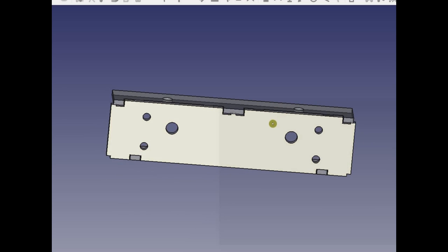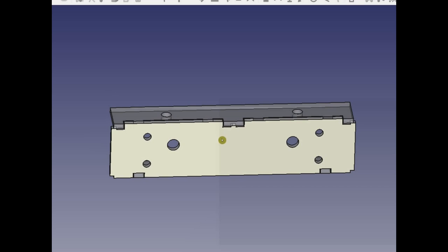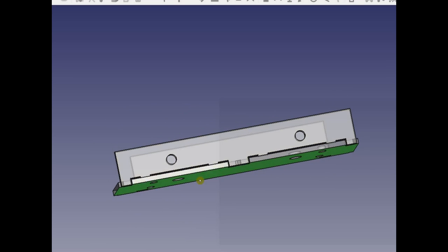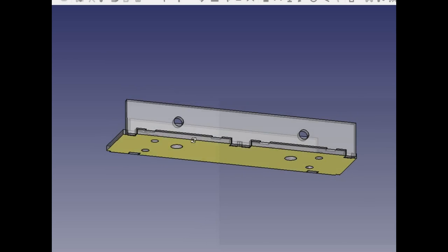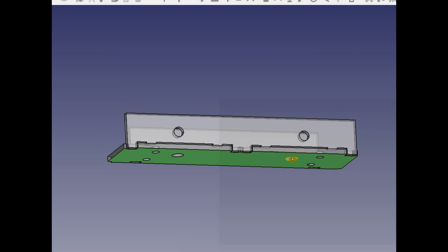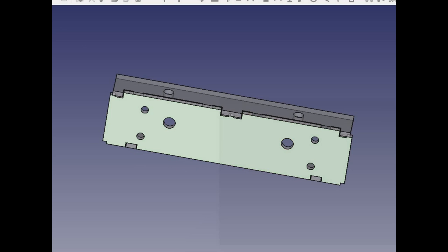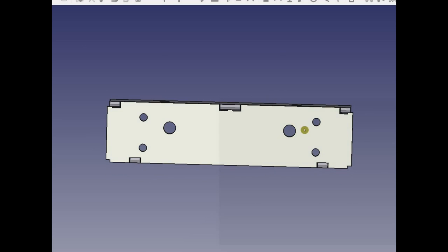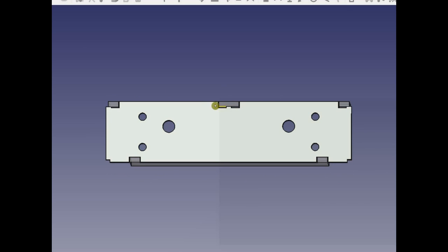Now, how do we get the DXF cutting files? Well, you're going to make this sketch for the front face, top face, and bottom face. Then you put them together. We're going to extract the DXF file out of that by going into FreeCAD and exporting as DXF. So don't worry about that for now. But that will be the final step, because then we get two-dimensional cutting files for CNC.